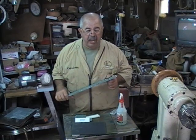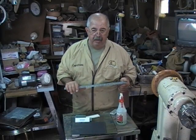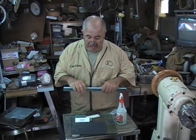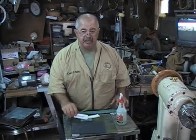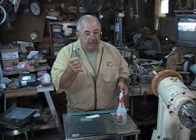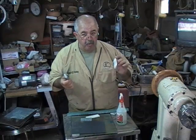So this is okay. It comes in a couple of different brands like Max and a few others. As long as it's acrylic, it's okay. Acrylic, you slap it over an edge and it cracks off, you're okay. Scratch it with a knife blade, you're okay. Those products you can work with. Now it comes in two thicknesses. I used to think it was 1/4 and 1/2, but it's actually 6mm and 12mm for you guys across the pond, where you use numbers you can work with.